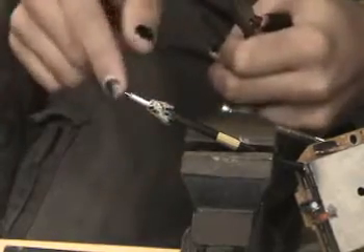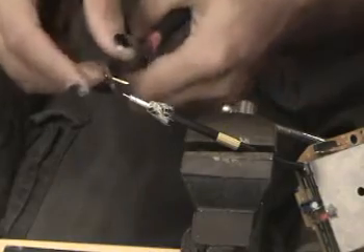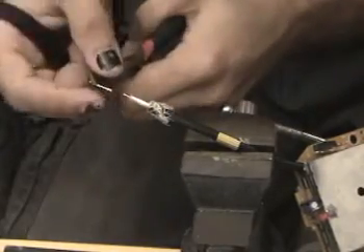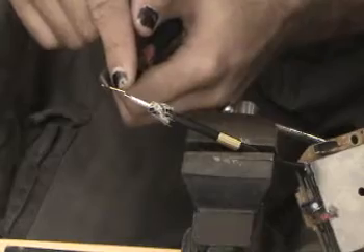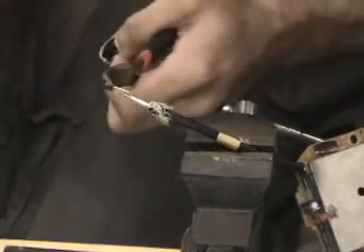Make sure that they're not grounded — make sure they're not touching. Do a visual inspection of that. What I like to do is cut this back and make sure that the center pin fits. Then I pre-tin this with a little bit of solder, just like so.